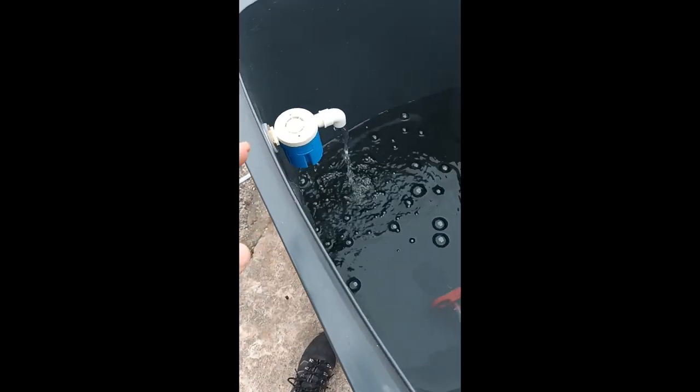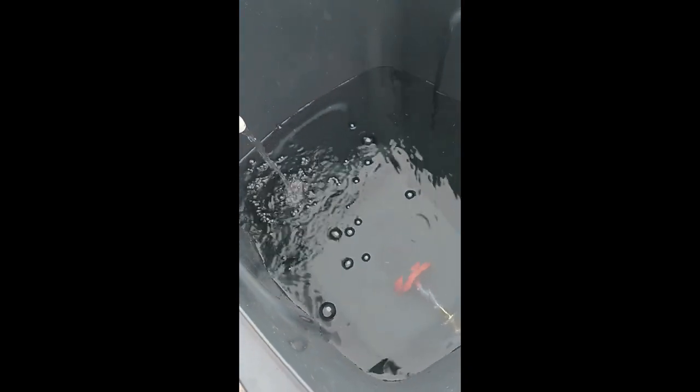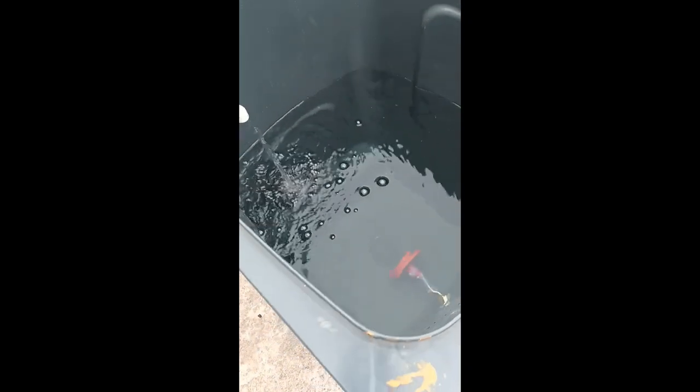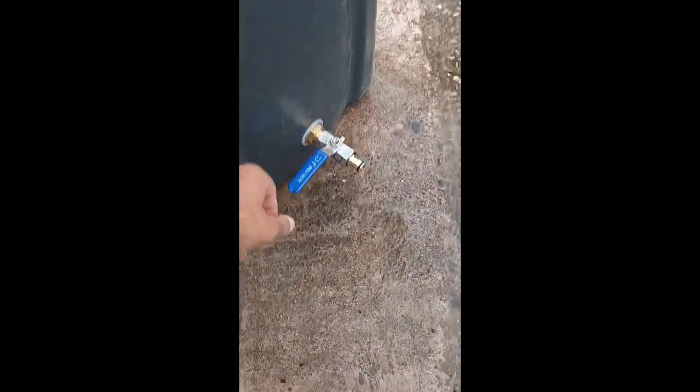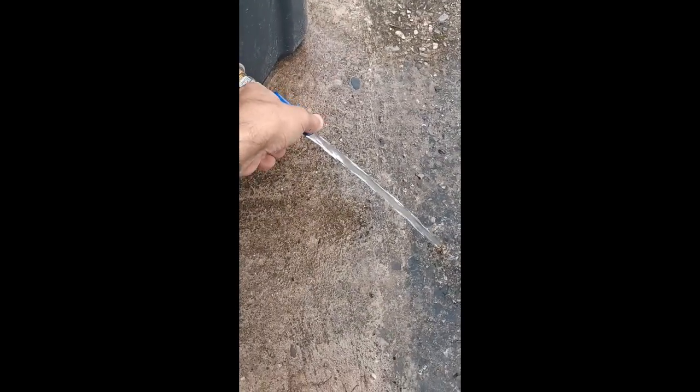The flow rate isn't fantastic coming from the mains — I worked it out to be about 15 litres per minute. You can measure that with a jug — a very simple calculation. But you can see when I turn the valve and open the water supply here, it is much faster coming out. Plus, remember the machine is also going to be sucking out some water as well.